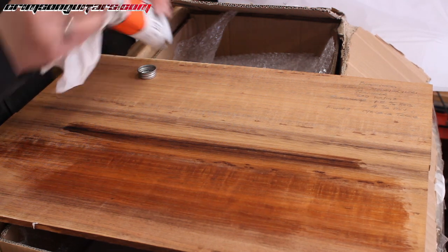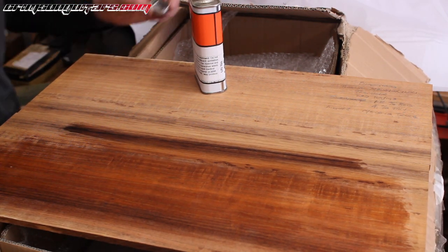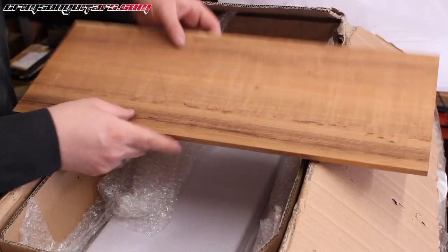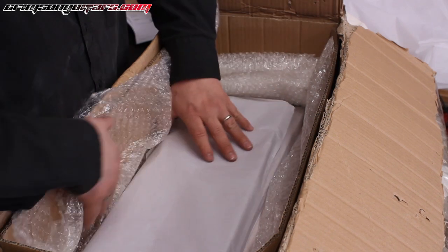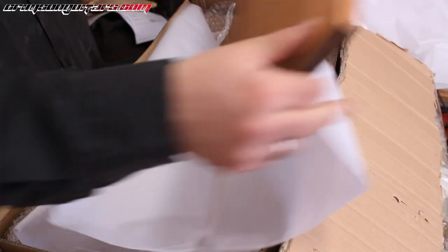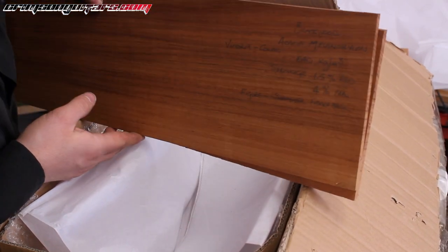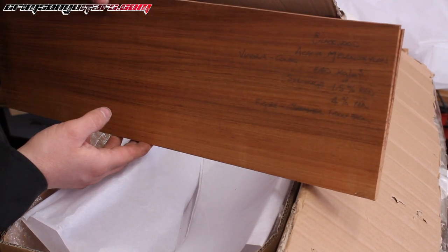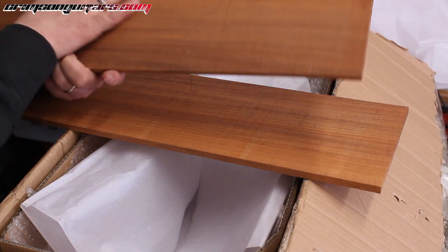These are fairly chunky — about 10mm thick for the most part. He said there are a couple of blanks in the bottom that also need re-sawing, but we're still going. This is another example of that acacia — acacia melanoxylon — which is called blackwood and is not black. 640 kilograms per meter cubed. It's fairly lightweight; it feels almost like mahogany really.